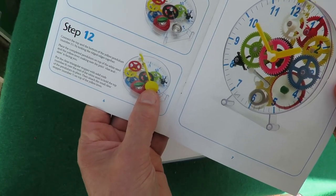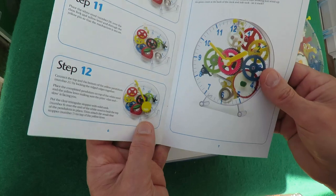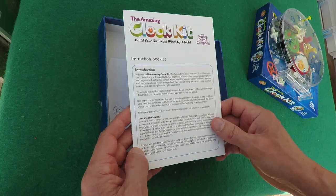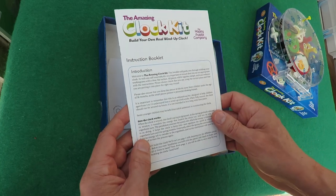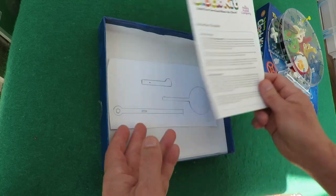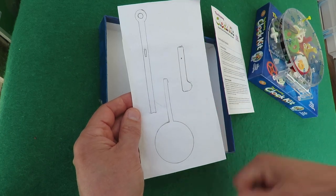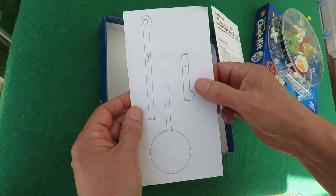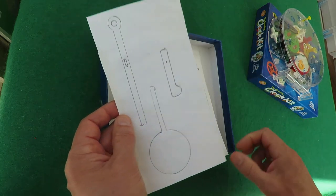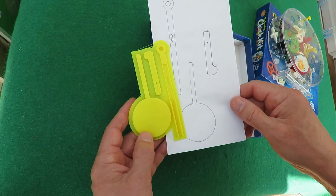I've got the full instructions with it, which is always handy. The pendulum is adjustable in length as well, so you can adjust the timing. As luck would have it, I think it was last year — I found another one in a different charity shop that was complete, and I kept it for a little while but then decided I didn't need two so I gave it away again. But before I gave it away I drew around the pendulum and also the little hammer thing that makes the bell ring, because that's missing as well. And now I have a 3D printer, so I've 3D printed a replacement.